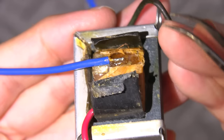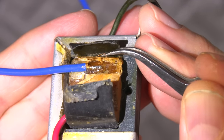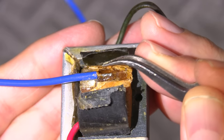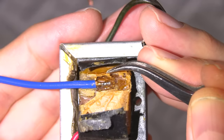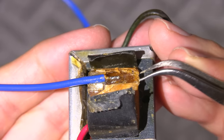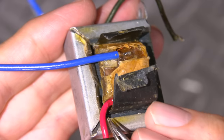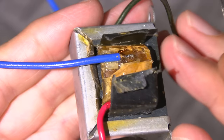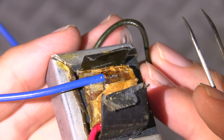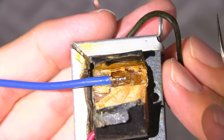So now keep in mind there's a lot of movement here because this is a 300 millimeter lens zoomed right in. So pardon the movement. So you can see that little wire is loose, right? And that's loose right into the transformer up there. So the only place that it's tight is right where it's attached here, and it's glued into place. So now that that's all done, I'll put the paper back on, and I even put a dab of glue on this side as well, and use the accelerator on that as well in order to make that wire just a bit tougher, because I don't want to have to do this again. So that should be a nice long-term fix.